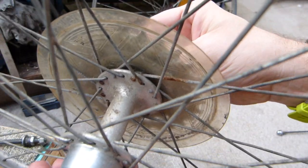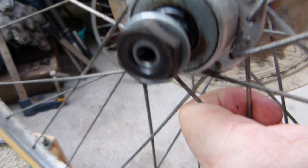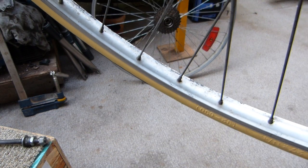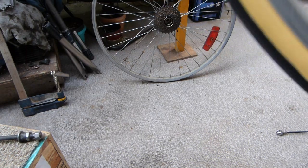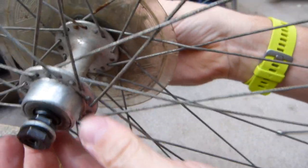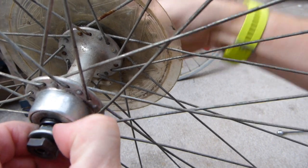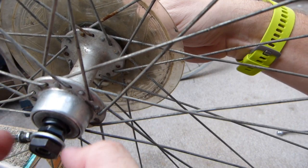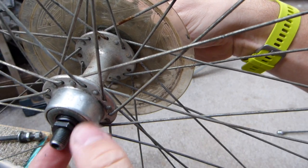At this point, I know you can't really see binding, but maybe you can hear it. This is a little bit binding — it's a little bit crunchy. It has to be felt; there's no other way to describe that it's binding and too tight. So it needs to be backed off just a little bit, like so — not too much. And the lock nut tightened in about this position. If the other washer and lock nut is annoying you, just get rid of it and work with just two things at a time. That's going to take another five minutes or so to dial it in — it's finicky.